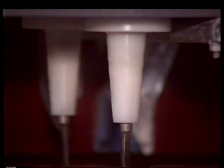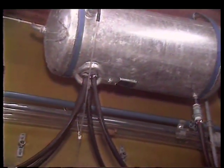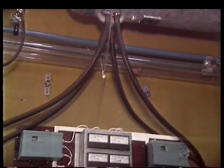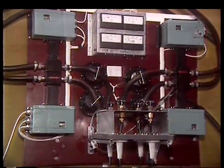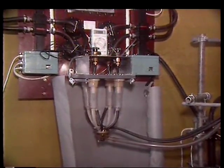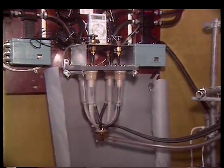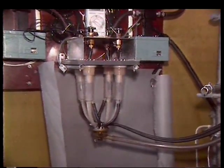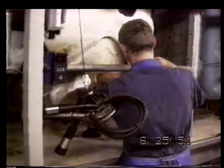The equipment consists of a water tank which via flow meters and flow regulation valves supplies water to artificial teats. The milking unit, which is to be tested, is attached to the udder and connected to the sensors which are required for the experiment. Both high and low line milking can be simulated.